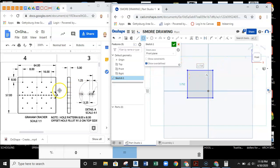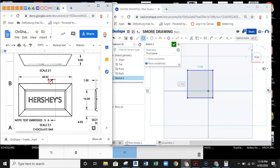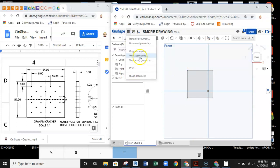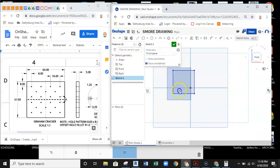One thing to note as I start this process: this drawing is all in metric. The note says 'Metric drawing — all parts dimensioned in millimeters.' So before drawing, I need to change my workspace units. Next to the OnShape logo, click the three bars, hit Workspace Units, change to millimeters, hit the green check, and now I'm ready to draw in millimeters.